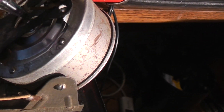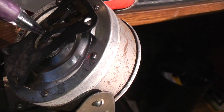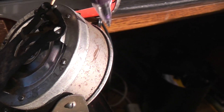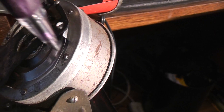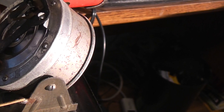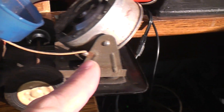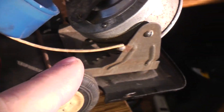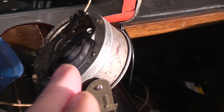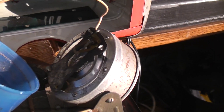There's this little piece right here — it's just a hinge piece of metal that can flop down. One wire connects to that side of the circuit; the other part of the wire connects to the metal drum, and there's a little divot on this diaphragm. Normally, because it's leaned back — and you can see they made it adjustable, there are actually stops under there so they could ratchet it back however much they want — gravity pulls the two contacts together and that closes a switch. So normally this is a normally closed switch.